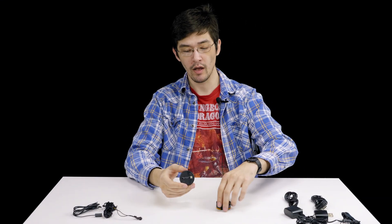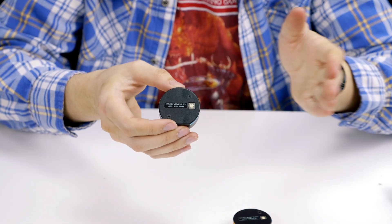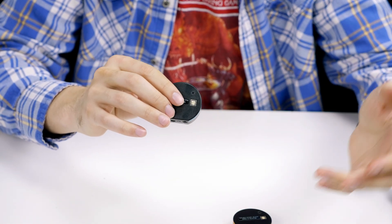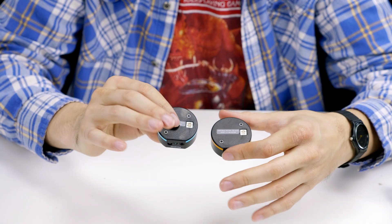The first common issue is a simple setup issue. One of the nice features of the Blast IR Wireless is it has a channel select, so if you have multiple kits you can either tell them all to talk to each other or tell certain kits to only talk to certain other kits. But if you only have one and they're set to the wrong channel it won't work correctly. So take a look at the bottom of both units — there's a little channel selector that you can switch with a small eyeglass screwdriver. Make sure that these are both set to the same channel. By default they come set to channel zero, and if you don't mess with it it should be just fine.